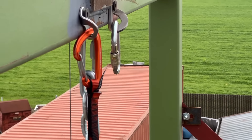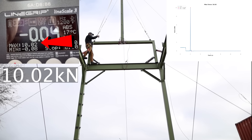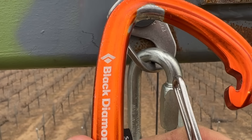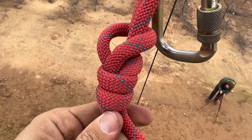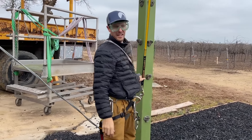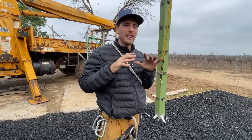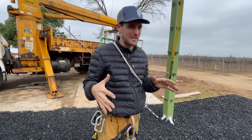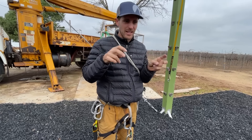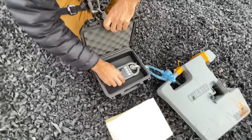Holy shit. What broke? You can see there's 99 next to the battery — that means one log has happened and we were at 1280 Hertz. So after 10 kilonewtons, the carabiner looks like this, the other side looks like this, and the figure eight looks like this. That was a perfect descent. I love testing things because it's never ever what I expect. The soft shackle fuse was supposed to be strong enough — the fuse being something that will break before the line scale. The line scale is safe.